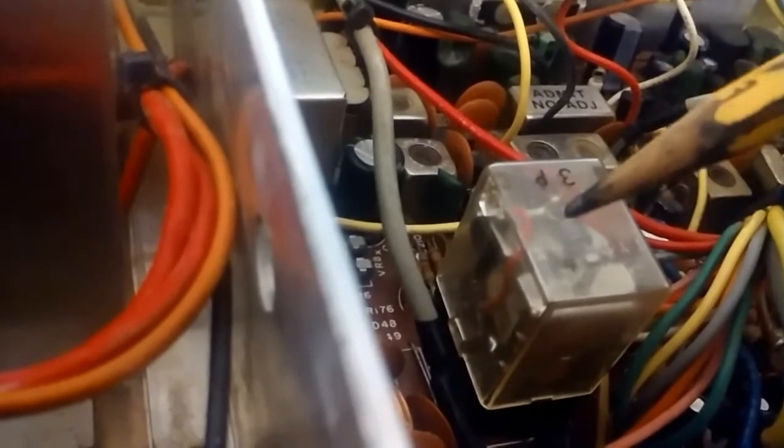You clean those with a Q-tip with the cotton end removed. Just clip it off with a pair of scissors. Use some contact cleaner again, and clean the stationary contacts, and then the floating piece that flips back and forth during the relay has contacts on both sides. Just don't use sandpaper or a file. You have to use something like hard card and electrical contact cleaner and rub it till the surfaces come clean, until you see there's no transfer anymore. Then you'll know these contacts are clean.